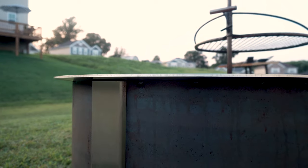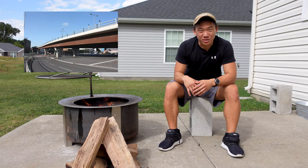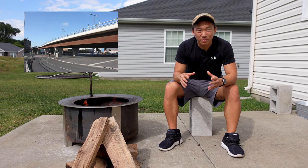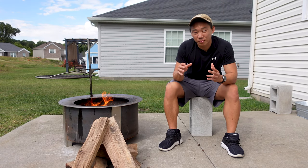The body of this fire pit is composed primarily of Corten steel. Unless you're a structural engineer that works with bridges or large structures, you're probably asking yourself: what is Corten steel and why does it matter? Corten steel is a name brand for what's called weathering steel, which is used to build bridges and other large steel structures. This type of steel is meant to develop a stable rust-like appearance, so it does not require paint, but also doesn't sacrifice strength over long periods of time in the elements. In the fire pit industry, this rust-like appearance is called a patina and is desired for its rustic appearance.